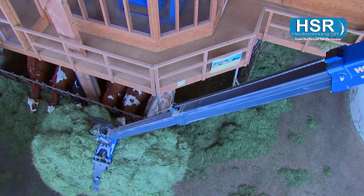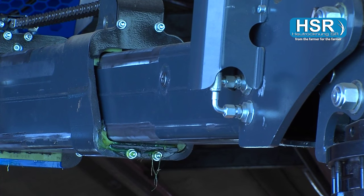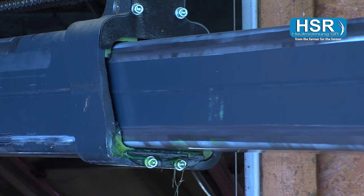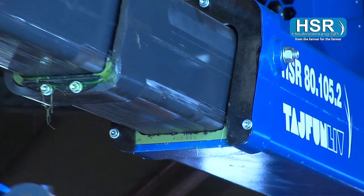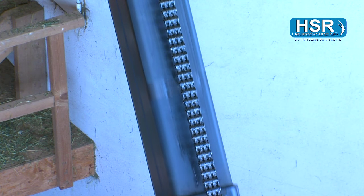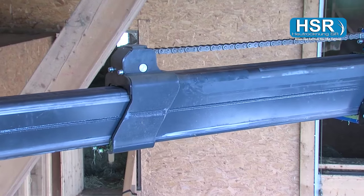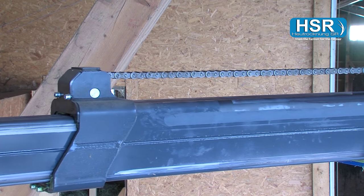In the case of all telescopic boom systems, either double or triple, the telescopic boom cylinders and hydraulic leads are located internally and are therefore extremely well protected against mechanical damage. Exchangeable and large-scale bearings ensure that the arms run smoothly. A 17-ton heavy double flyer chain pulls the fast telescopic boom. The telescope arms are finished in high-strength quality steel Domex 700.